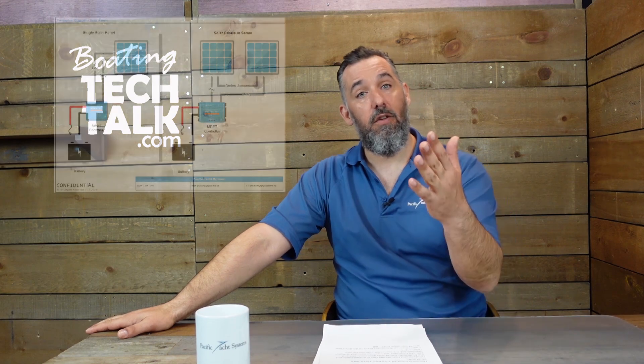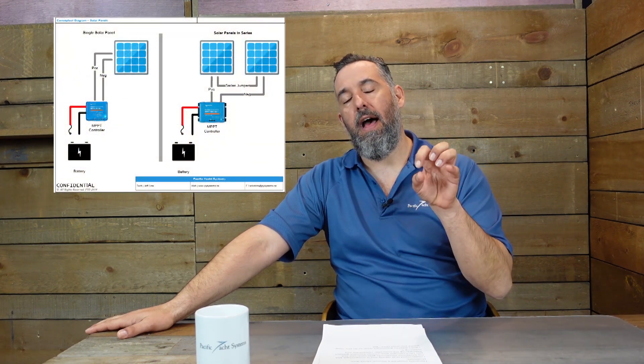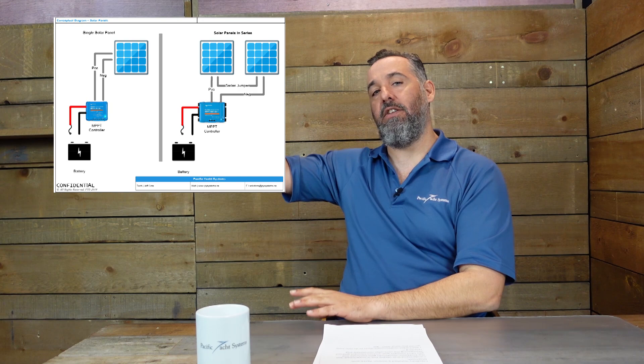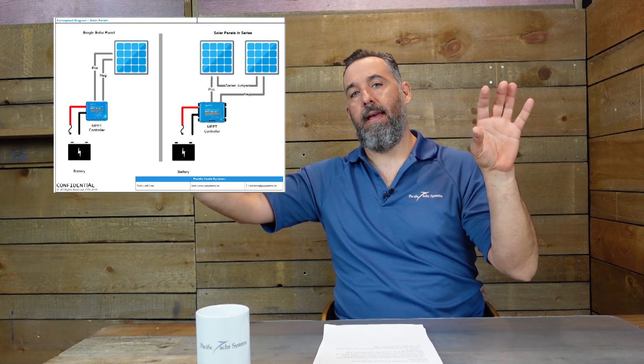Failing that, Bill's right — sometimes it's good to actually depower the device, and the way you do that is by removing the fuse. There's a fuse located at the battery that is interconnected to the solar controller. So your batteries are here and your solar controller is here — there has to be a fuse between those two devices.